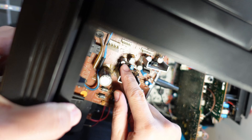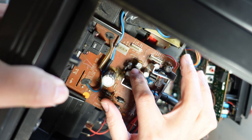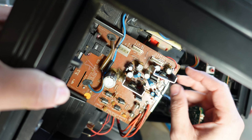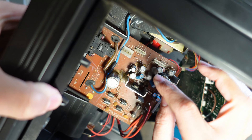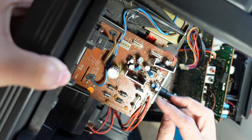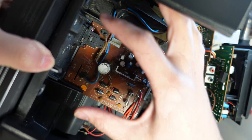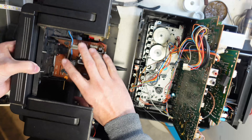Looking inside here, I can see some kind of oxidation by this capacitor. But I don't think it is directly connected to these capacitors — it might be the yellow glue used on the PCB. I've seen on other YouTube channels that this glue can become conductive or corrosive and start breaking parts and connections. So I will take this board out and analyze it outside this big frame.